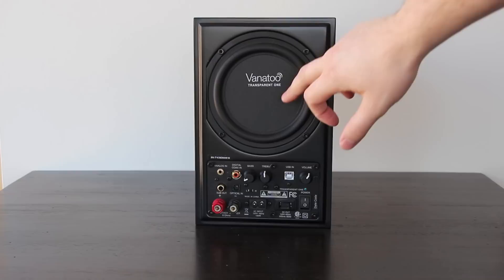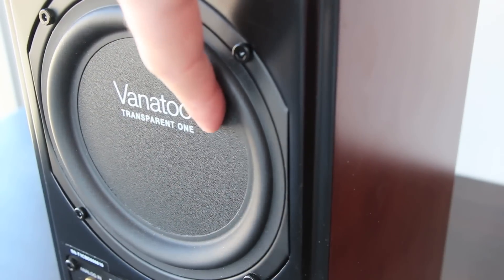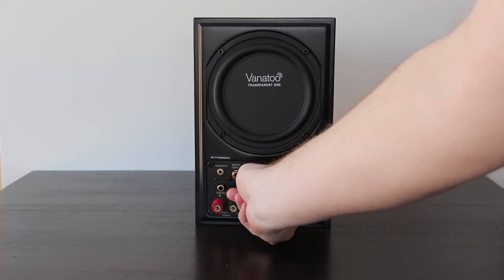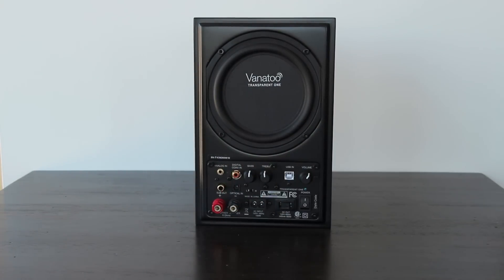As you can see from the back, there's a five-and-a-quarter inch rear radiator that helps with the bass. I found these speakers work best when they have about seven inches or so of space behind them from the wall — they can tend to be a little bassy when placed too close. You can adjust that with the tone adjustments, but for the tightest bass, a little breathing room is best. With that spacing, I found these to have a pretty flat frequency response, which is very nice.